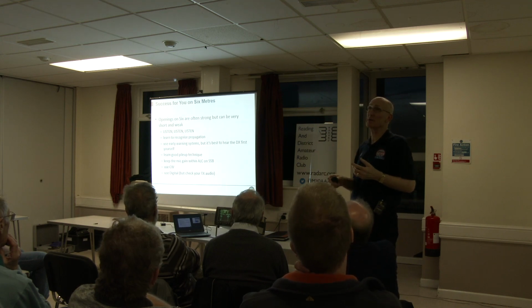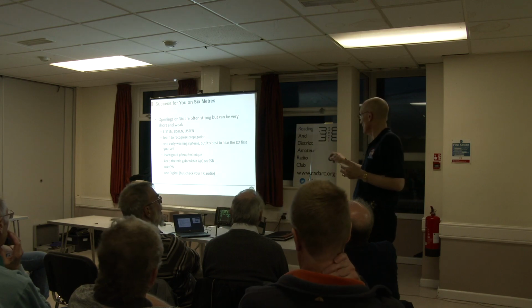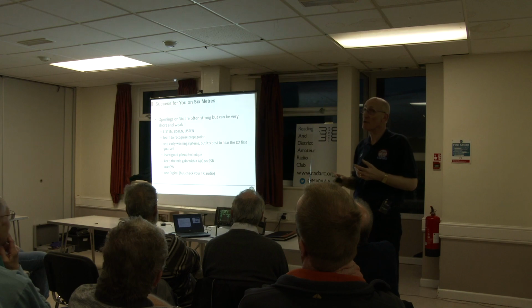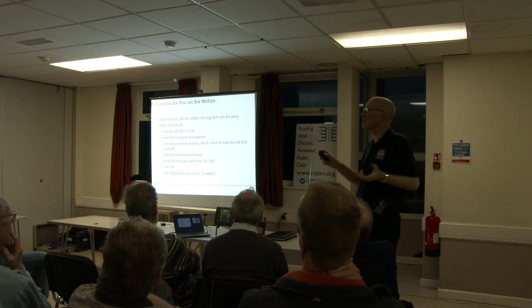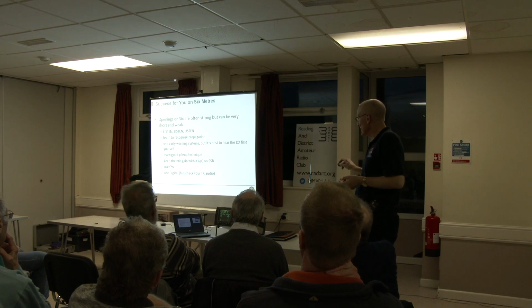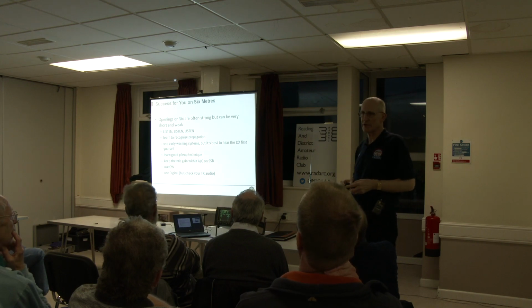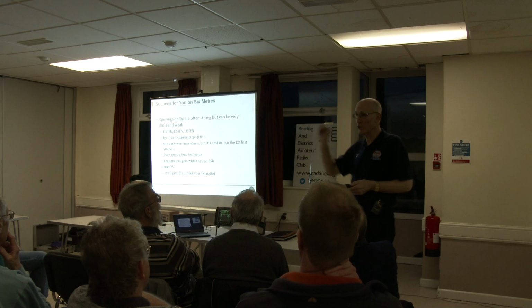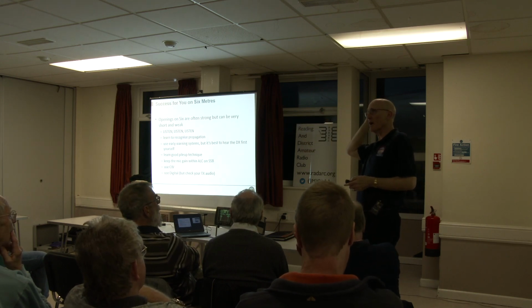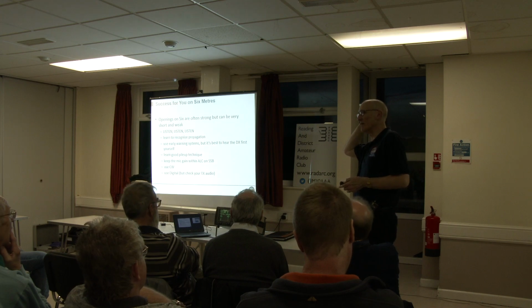Pile-ups, in the old days we didn't have split and all that kind of stuff, but they do work split now. Don't overdrive your rig, it doesn't make you any more intelligible. You probably all know that. Well, at least you all know people who don't do it. The interesting thing is that the same thing can happen on digital. If you overdrive the audio into the rig, you get spurious emissions of various kinds.